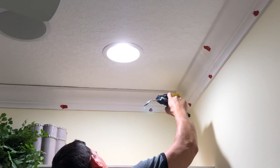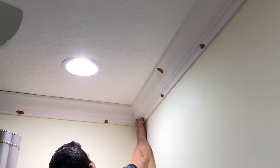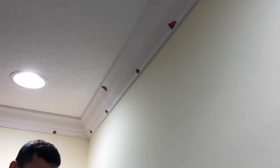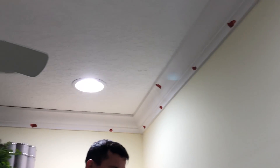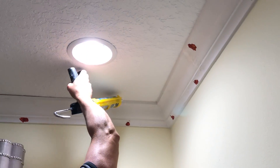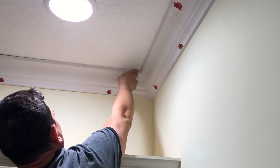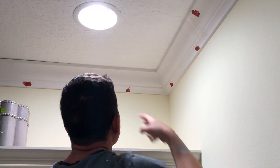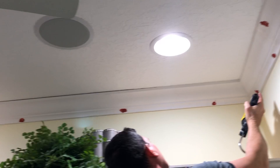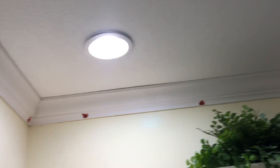Right now we're putting Alex Plus caulking to fill in the gaps that occur between the ceiling and the crown at the top, and the wall and the crown at the bottom. If you look at that material, you'll see it's DAP — the white one. It's a very thick caulking that doesn't shrink that much and it's fast drying. If you use the clear, it's not as firmly constituted as the white fast-drying version, so the white is the better stuff to use.